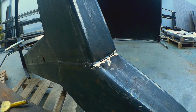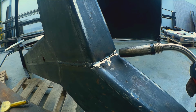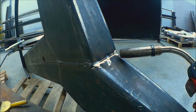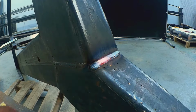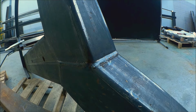And so, other faces now. Okay, so this is the last weld on the main structure, if you like. Now there's a little bit of a gap here, so I'm just going to take it easy. Probably would double back and round, doing little circles rather than cursive e's. But I'm pretty happy with that as well.